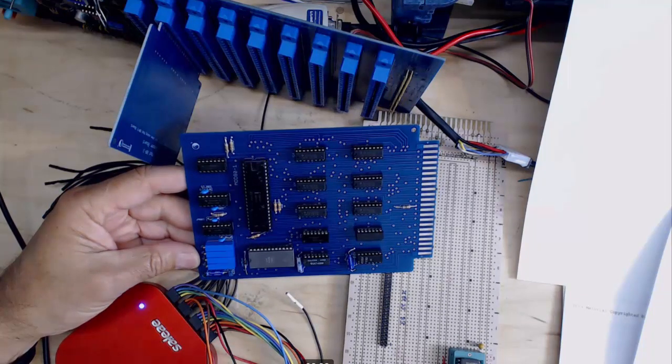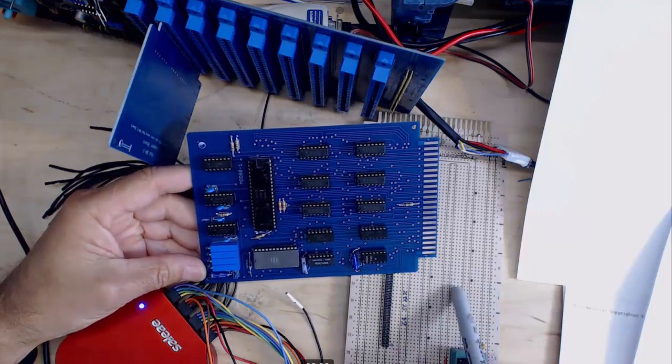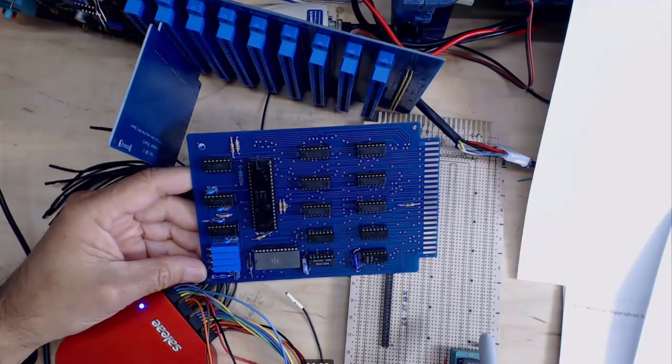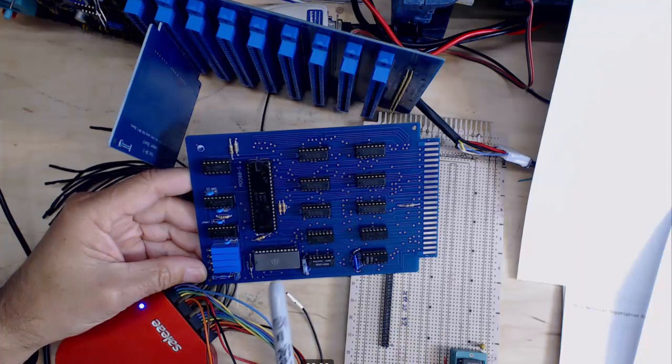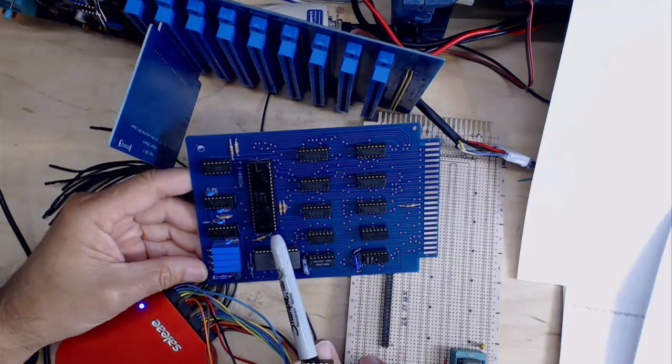So what I was getting was it was getting the first instruction. So it was fetching. I knew this card worked okay. So it was fetching the first instruction from the bus, and then when the memory read should have been dropping on the rising edge of phi 1, I think the next phi 1 MRE should have dropped, it wasn't dropping. So the long and the short of it, and I'm somewhat ashamed, it took me several minutes to find it, if not a little longer than that.